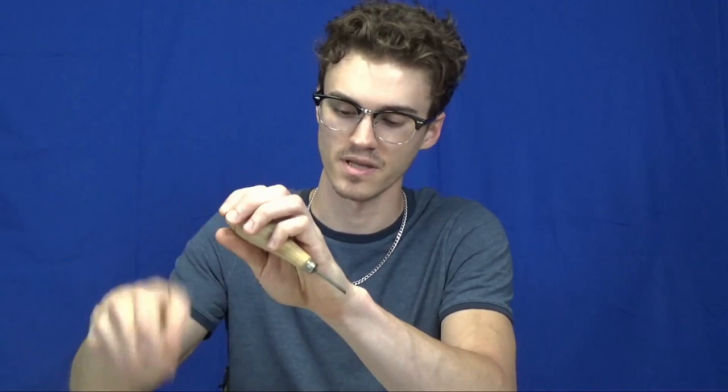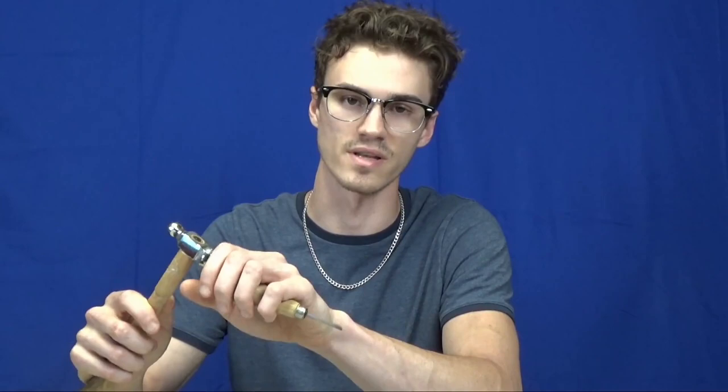My number one tip with doing your heel is to start off small. If your heel is too small it'll just dig into the metal as you tap it, until it won't move anymore because the heel isn't big enough to keep it from sinking. If your heel is too big you'll have to raise your hand too high and you won't get a deep line — it'll just scoot along the surface. That said, it's easier to fix a small heel than a big one. With a small heel you're removing very little material; if it keeps sinking, just do a little more sharpening and test it again. A heel that's too big requires resharpening the entire face, which takes much more effort.